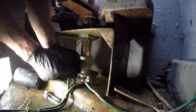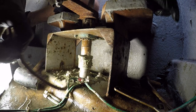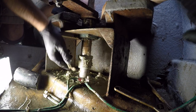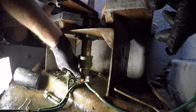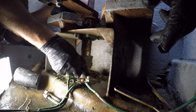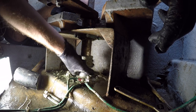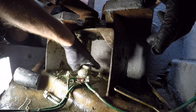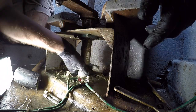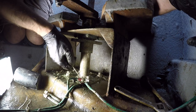The stuffing size is one quarter inch — I originally purchased three eighths but that was too large. I measured and cut the stuffing piece, the packing, with a 45-degree cut so there's an overlap on the seam. I tried using the clamping part to push the packing in, but that didn't work so well. Using the pick and working it in was effective.